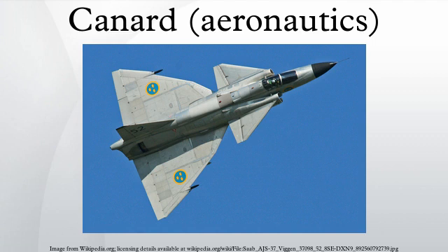The Beechcraft Starship has a variable sweep canard surface. The sweep is varied in flight by swinging the foreplanes forward to increase their effectiveness and trim out the nose-down pitching effect caused by the wing flaps when deployed. A moustache is a small, high aspect ratio foreplane which is deployed for low-speed flight in order to improve handling at high angles of attack such as during take-off and landing. It is retracted at high speed in order to avoid the wave drag penalty of a canard design. It was first seen on the Dassault Milan and later on the Tupolev Tu-144. NASA has also investigated a one-piece slewed equivalent called the conformal retractable canard, where as the surface is stowed one side sweeps backwards and the other forwards. The Rockwell B-1 Lancer shows small front fin surfaces as part of an active vibration damping system that reduces significant aerodynamic buffeting during high-speed, low-altitude flight.